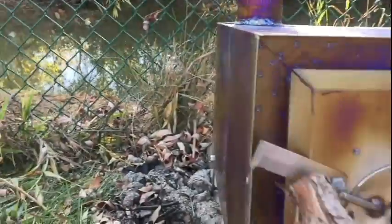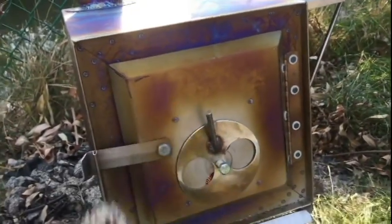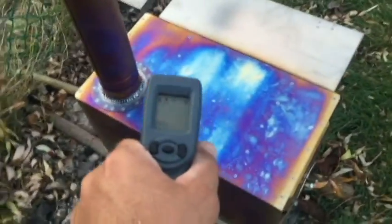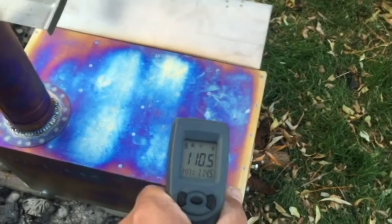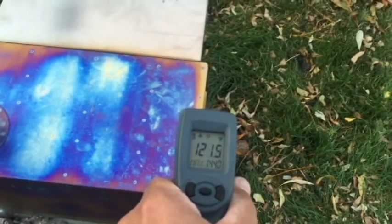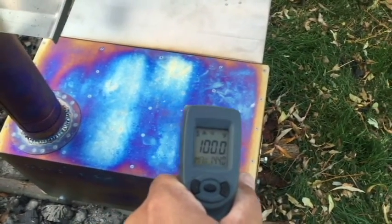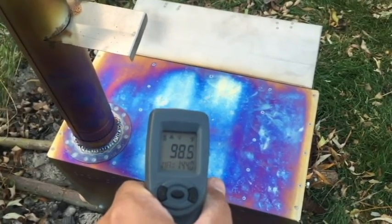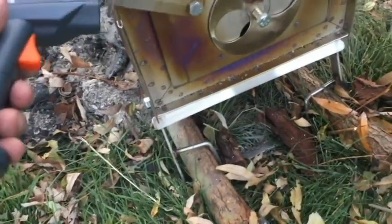Let's close this up and shut the front damper all the way down. Let me give you an idea of what kind of numbers we're at — we've cooled down considerably. We're in the 90s here, 140s as we get to the front. We're actually hotter right around the baffle, which is about right here, so right above the baffle. The sides are the coolest.